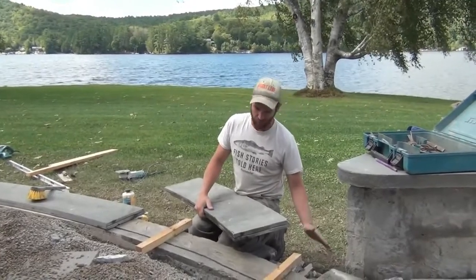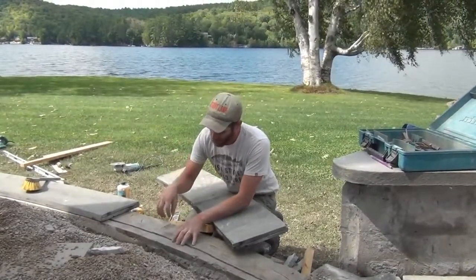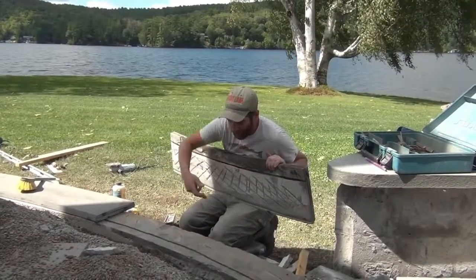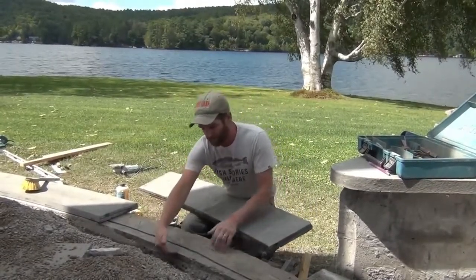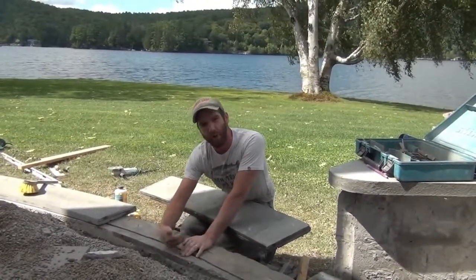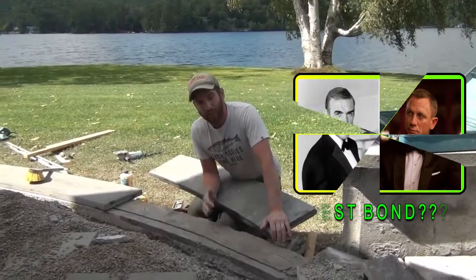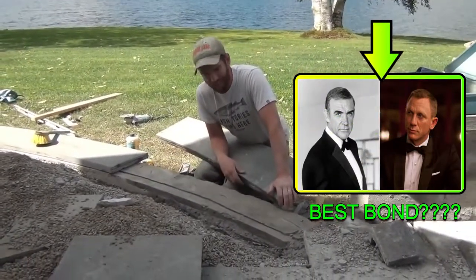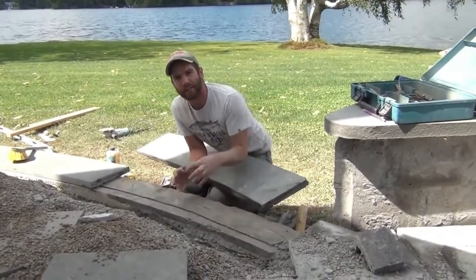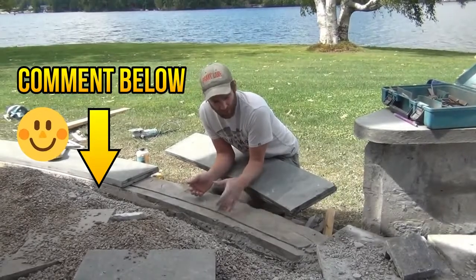We're not quite that fancy and artistic here, but we made this drip edge so the water is going to drip away. Then we put a keyway in the top of this concrete wall so our new mortar gets bitten into that lower keyway, and a corresponding keyway into the top of this. Even if there were a few molecules of water going in, they should run into that with no more continuation across. You'd think that bonding stone to mortar to mortar to concrete is simple, but those things don't really like each other and it doesn't take much to break them free.